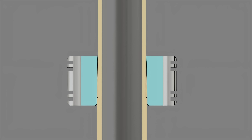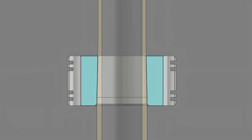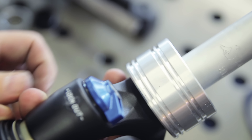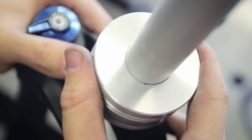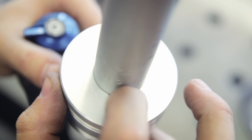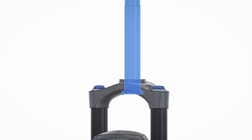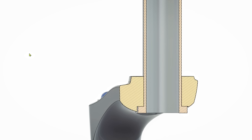Going back to the model: if I build the pulley with a straight bore it obviously won't work because it either won't clamp properly or won't slide all the way down to the crown. One solution would be to replicate this taper and turn a tapered feature inside the pulley — but the problem is you'd have to get this very slight angle absolutely perfect, down to a fraction of a degree, to get a decent fit. Long story short, I actually tried doing this and failed. The first version of the pulley didn't properly fit, so I had to scrap it. Eventually I went with a different solution.